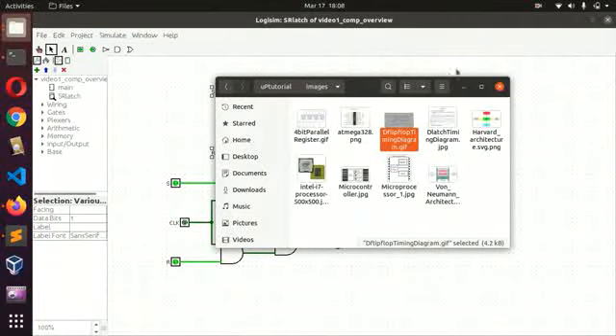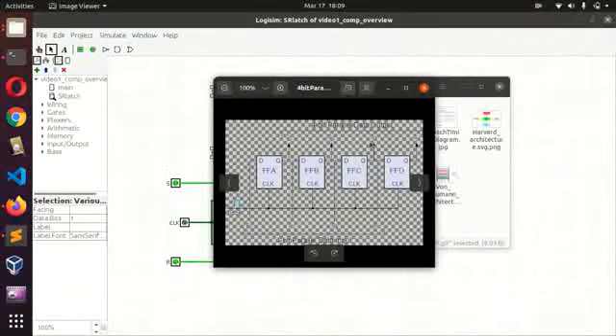So how does that relate to registers? Basically, registers are just a combination of flip-flops. What we're using is a D-latch and a D flip-flop. So registers, on the other hand, they are just a combination of these flip-flops. It depends — you can have a register that is a latch and then you can also have a register that is made of flip-flops.